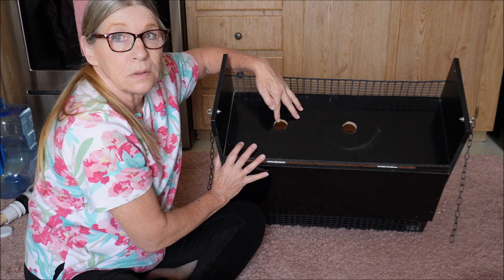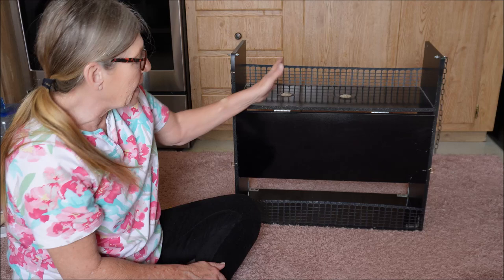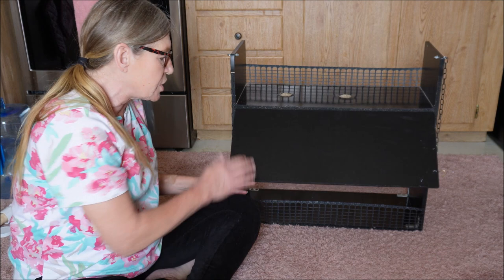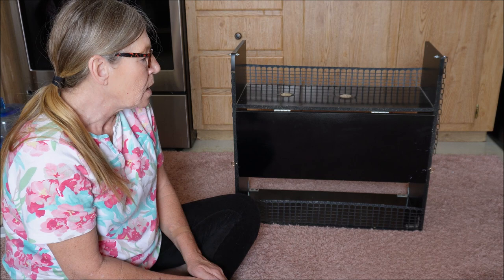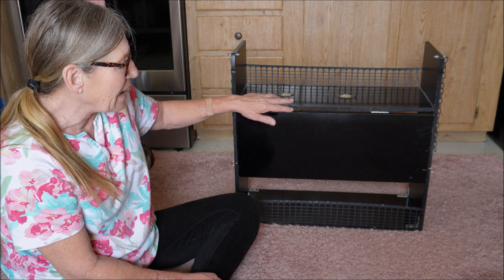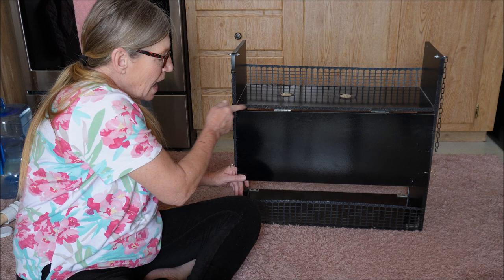The holes I drilled are inch-and-a-half, spaced a certain distance apart — this side is where the bowl sits, this side is where the faucet sits. I also applied high-gloss black vinyl contact paper on each shelf so water spills won't damage the particle board. It can be damaged easily with water, so you have to wipe it up right away, especially around hinges — swelling can cause hinges to fall right out. This other side is just painted and not protected by vinyl.